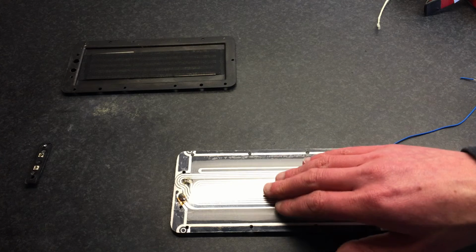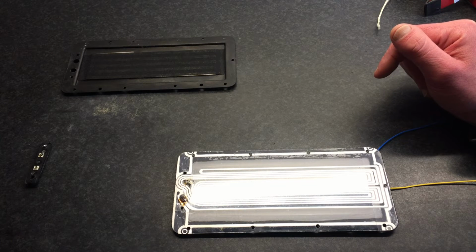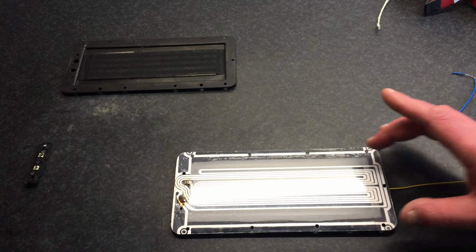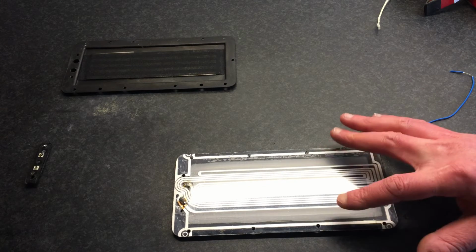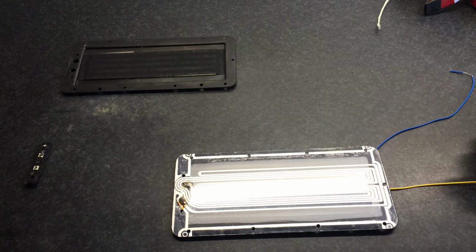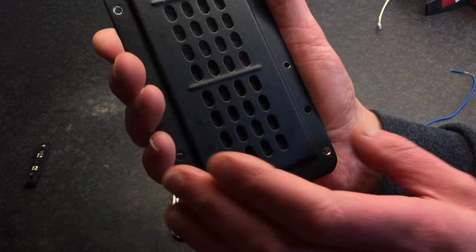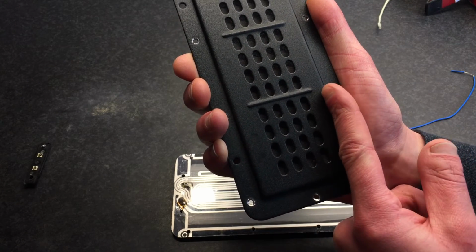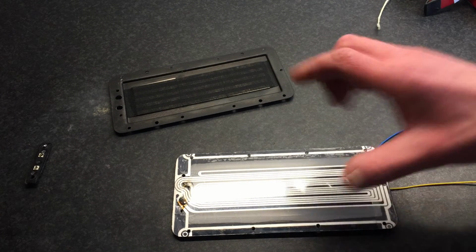If you look at the very big fat tension on this thing, I measured it real quick, and it is a 350 Hertz resonance, which doesn't sound that high. It feels much higher, but then again it is quite wide. The foil actually extends to here, this whole piece. It's even wider than the tweeter panel, and the PDR3, for instance, is slightly smaller in the width as well. If you look at the front of a PDR or a Neo 3, it is the same, but this piece here is less wide in the tweeters. So even if their tension is as high, the resonance of this one will be lower.